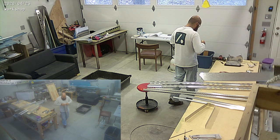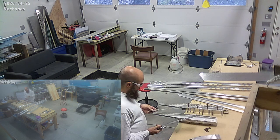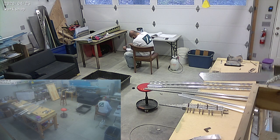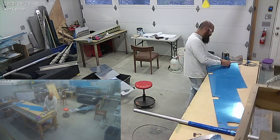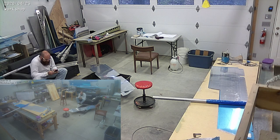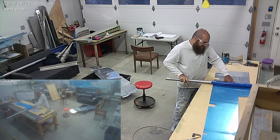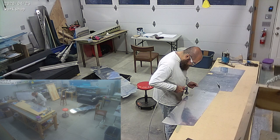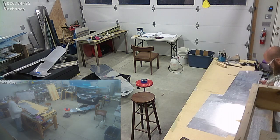There is, you can see there, so there are some elevator spars, front and rear spars. I'm working on the end ribs right there. You can see them clecoed, and there are the elevator skins. I'm removing the plastic with that tubing. I think it's one of the elevator pushrod tubes. But deburring, cleaning things up, bending the edges.